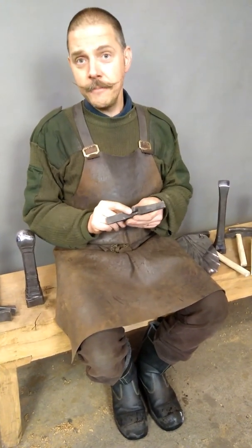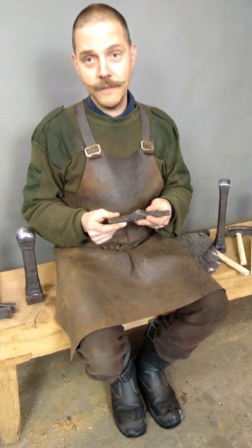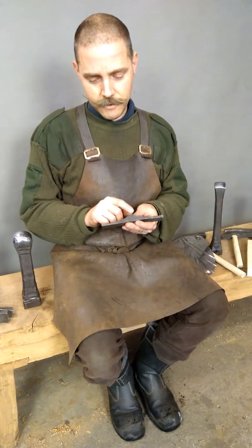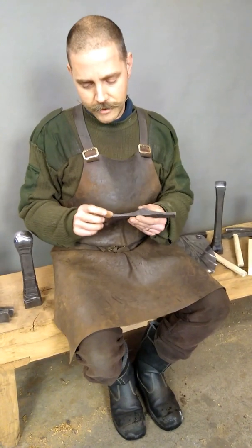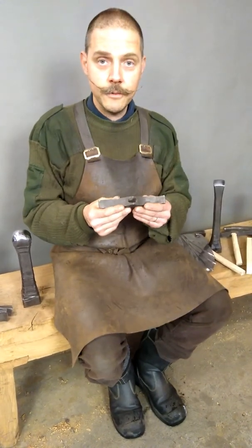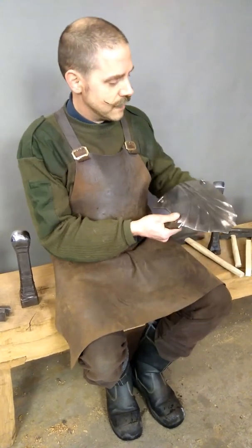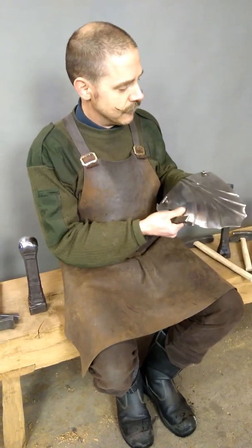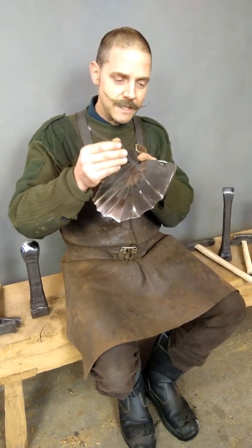Here I have a hammer head that's been forged by David Esmert, made of mild steel from the 17th century. Here it has forged-welded steel on the heads. This hammer I will use when I make flutings — this one is made with a similar hammer. I put this on a comb and use the hammer to strike it just beside the comb like this.